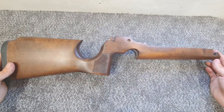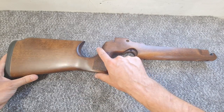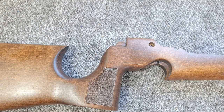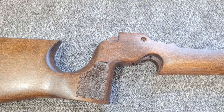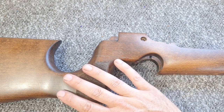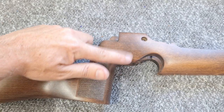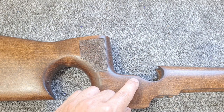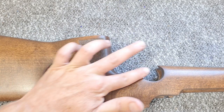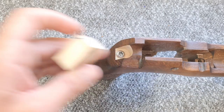It's the next day - I've got the clamps off now. I've just had it out in the daylight and you can see the lacquer that's on here is not in particularly good order; there's a fair bit of tear-out around the crack itself. Going forward we're going to be painting this one. The best course of action would normally be to do a full strip, take it back to the bare beechwood, mix up some beechwood dust to fill the voids, then fully refinish it with some stain and oil or a tinted lacquer. But as we're painting this one, I'm going to flat this back very carefully with 1200 grit. These little voids I'm going to fill with super glue and buff them back with some of the dust.